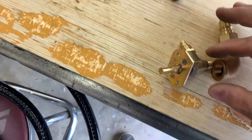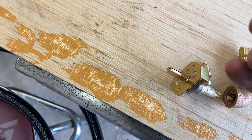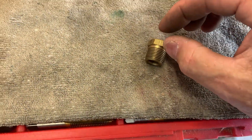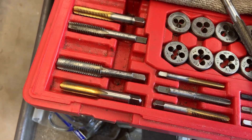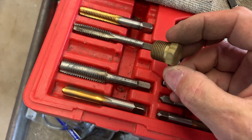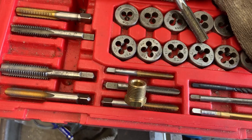I'll save you the pain of me trying to hold the camera, but it's going to be perfect length. So all we're going to do is drill this thing out and thread it — and that might actually be the right thread hole size right there. I know these caps don't have much thickness in this end, so if this hole size isn't conducive to threading... oh yes, it'll be perfect. The right thing to do here would be to just chuck this up in the lathe, bore it out, and tap it. It'd be a real simple little job and then we'll be all set.